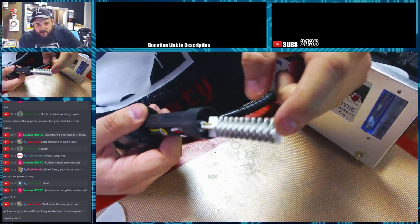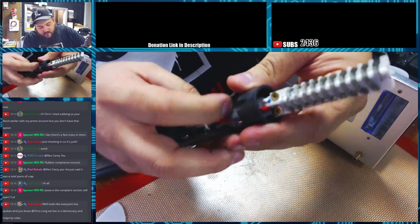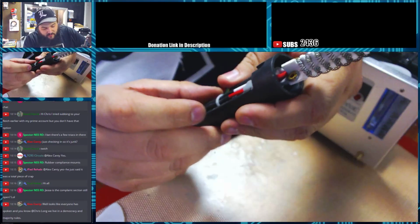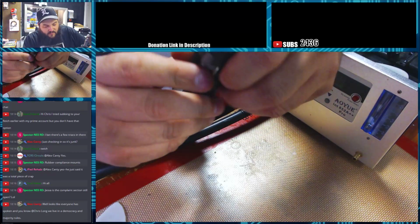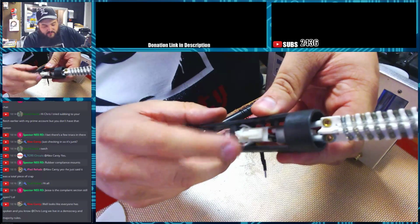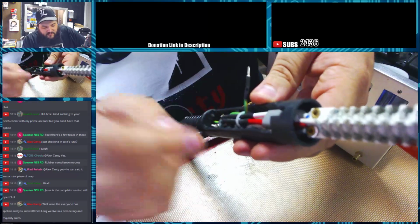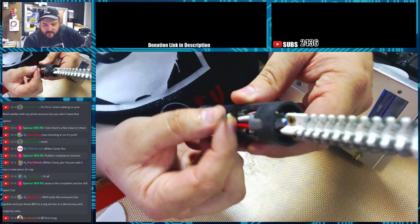This is a ceramic core, which has, you can see here, that's exactly what these two heavy wires coming up, the red and the white wire, are the temperature probe leads. And then on the other side, we have a black and a red wire that plug in through this plug. They go to the actual coil piece that's your heating element. Underneath here, it's not soldered, it's actually these press-in pin connectors.